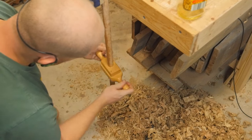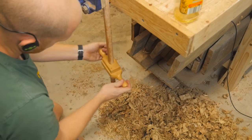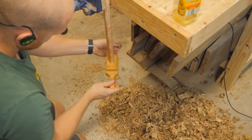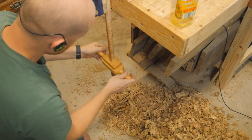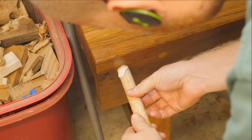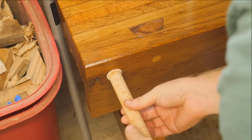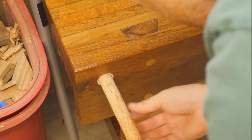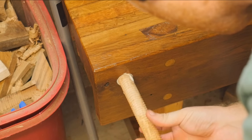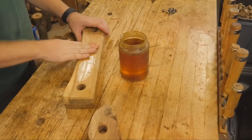For the screw I'm using a one-inch rod, and I find it easier to screw up the rod and down the rod - that allows me to put some oil on it and make it a smoother ride as the screw block slowly works up through the rod. After that I can glue them in place, which is very easy because you can just put glue under the rod and screw it into the hole. I like to run it in a ways and work the glue all the way in, then back it out and add some more glue and screw it in a little further. I keep going until it's tight and that's never going to move again.